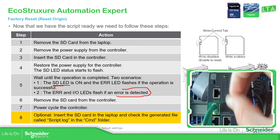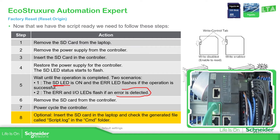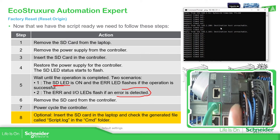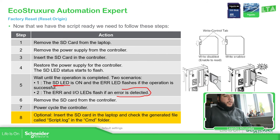What we need to do is remove the SD card, then power cycle the equipment. Remove the SD card and put the power back again. It usually takes between 50 and 55 seconds to connect and have it done again. As we have done the factory reset, the IP address I had assigned is lost and it's now using the default one. So even if I use the previous ping, it's not going to do anything at all. We have already done the factory reset — the IP address is lost, which is good. I have the default one once again.